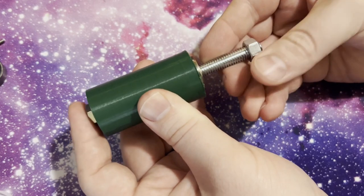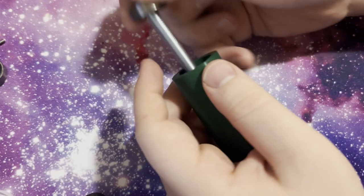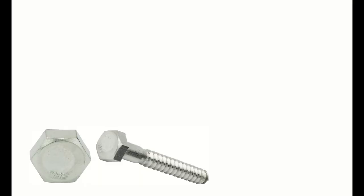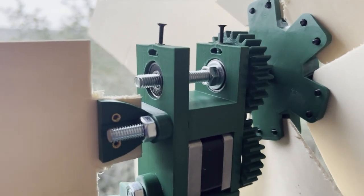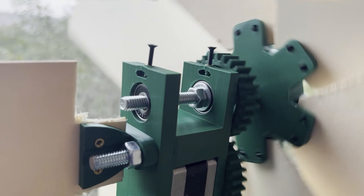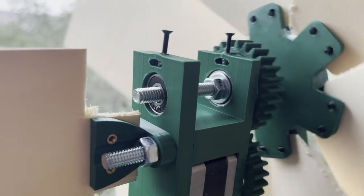There are also a few different types of bolts specifically made for mounting bearings — lag bolts, carriage bolts, and shoulder bolts — which all seem like basically the same idea. They have a plain shaft for a bit, then the bolt thread starts. I've found that these specialty bolts are just as susceptible to all the problems I talked about in this video, but they're much, much more expensive. So I gave up on them and just use my own methods instead.